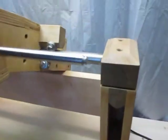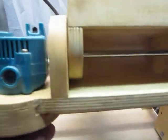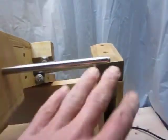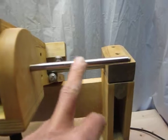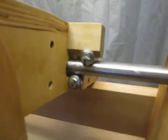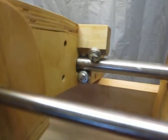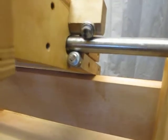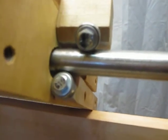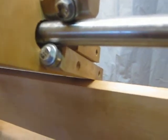That's another piece of pipe I found around. The shaft for this part came from a discarded printer — there are usually a couple of them inside and they're easy to work with. The roller bearings came from one set of roller skates. They have about an 8mm inner diameter and I think 22mm outer diameter.